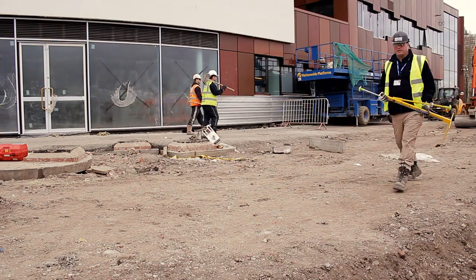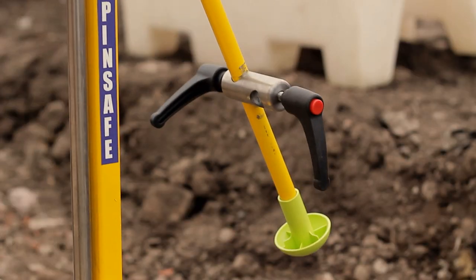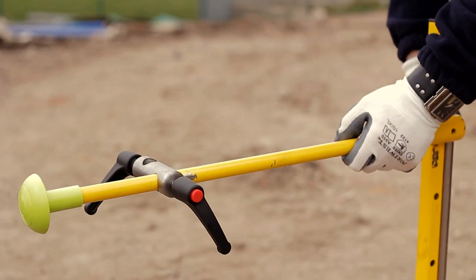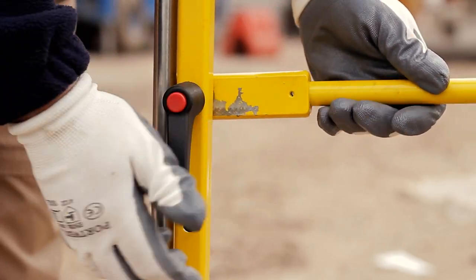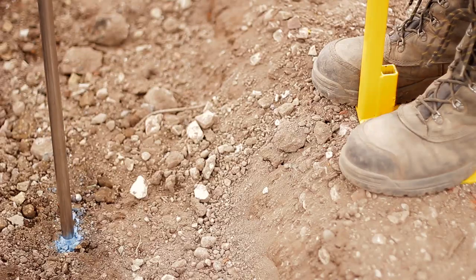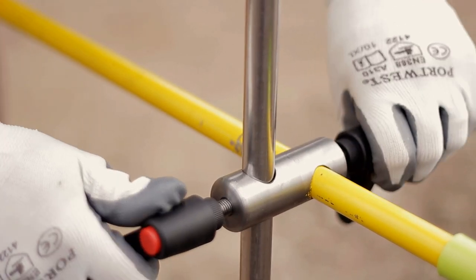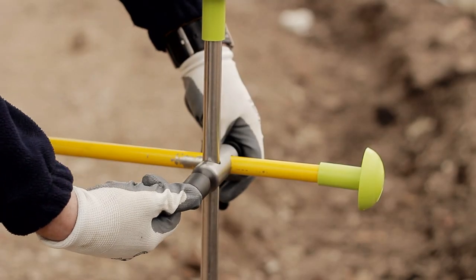Step 2: Setting up Pinsafe. Position the base of Pinsafe adjacent to the engineer's mark. Loosen the ratchet lever. Raise the crossarm to a 90 degree angle. Tighten the ratchet lever to support the crossarm. Loosen the pivot knuckle to ensure positioning of the pin onto the engineer's mark. Check bullseye level. Tighten all levers, ensuring they are all turned down to the 6 o'clock position.